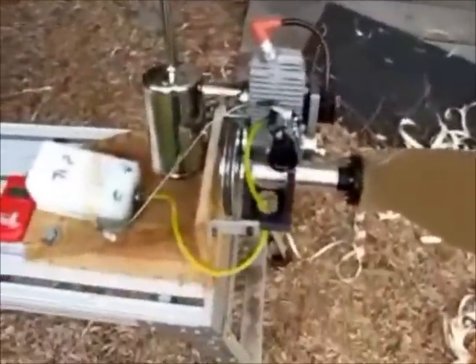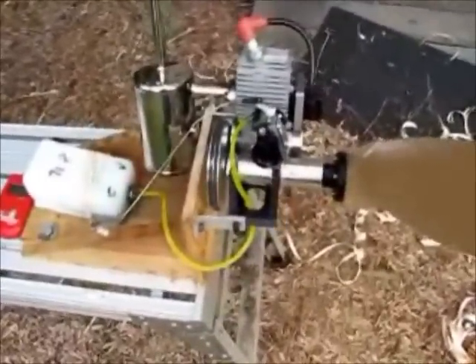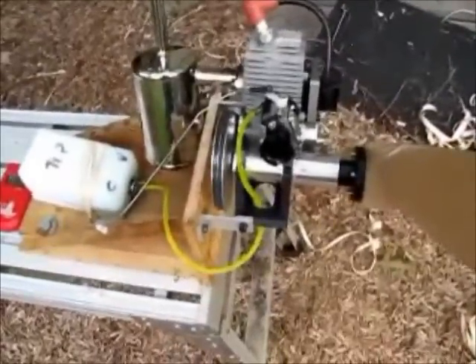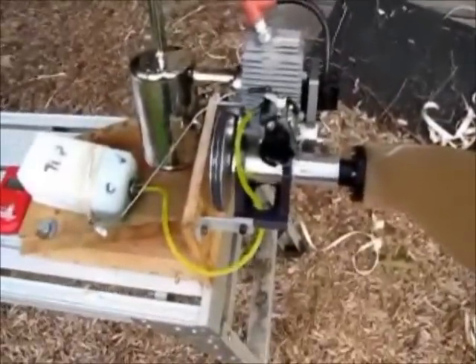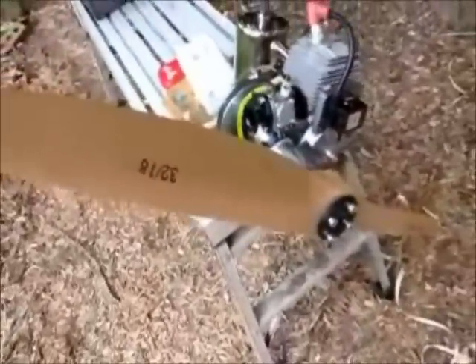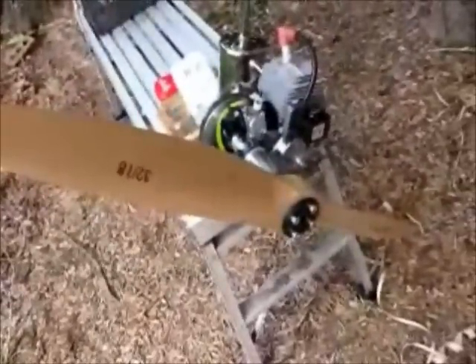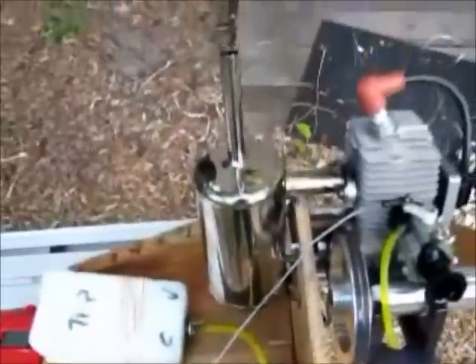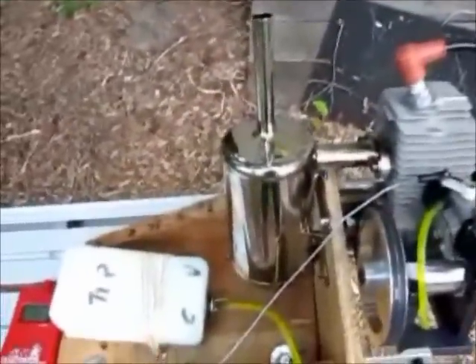What this is is the Tony Clark reduction drive. It's two belts driving from the back of the G38 to a larger shaft driving a 3218 propeller, and engine speed is about 7500 RPM. The muffler is also a Tony Clark product and you can tell it really muffles very nicely.